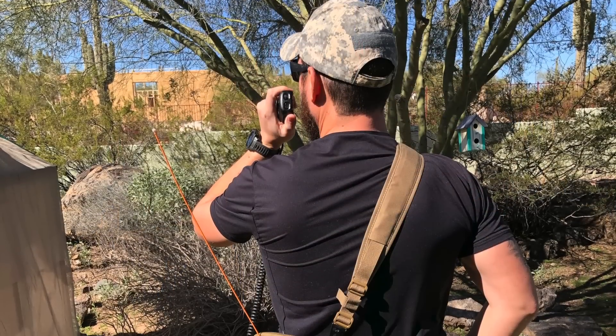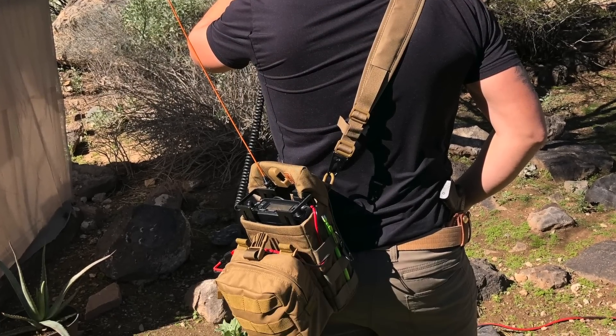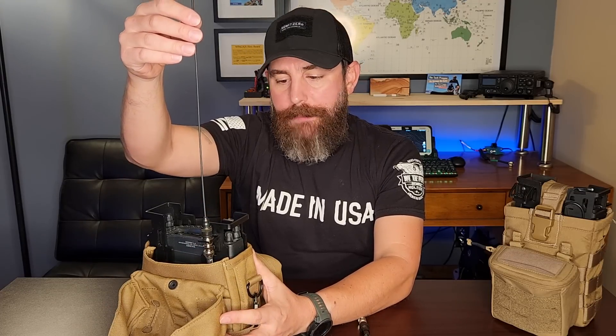Let's establish at least some basic operating principles if you're going to try to run a whip antenna. I see guys mounting this on their back, so that radiating element is very close to their head. In general, I would observe the operating principles from an HT and probably not run it at more than five watts — ten on the top end if you are short with your communications. If you're going to drop it off your back and put it on the floor, still running your whip antenna, still not a great idea — I would say no more than 20 watts. That's mostly to protect you from RF exposure, but also to protect the radio.